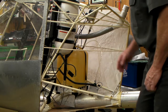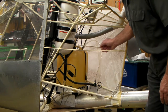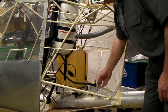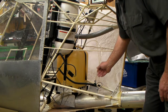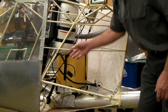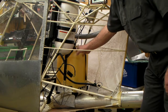I should maybe point out some of the things here, because someday somebody might want to see how this is hooked up — it's kind of hard to see back here. This is the fuel transfer hose that goes to this little electric fuel pump. The hose on the bottom isn't hooked to anything right now, but it can be fed to a different tank to refill this in flight if you need to ferry the aircraft someplace.